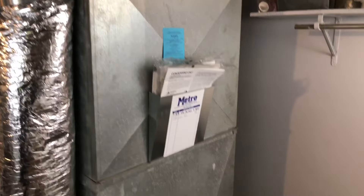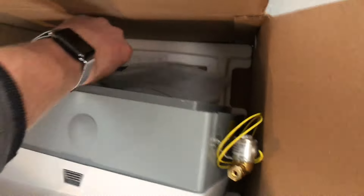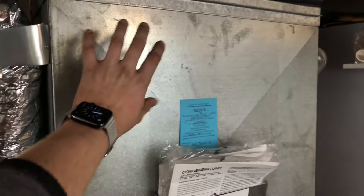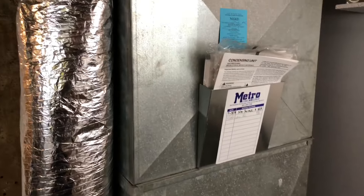I'm going to get the template for the cutout. The template is actually your instruction sheet — it's just an eight-and-a-half by eleven piece of paper. I'm going to put that on the furnace, make a sharpie cutout, and then I'm going to get my drill bit and my shears. These are commonly available anywhere for just a few dollars and will make this project very easy. So there we have hole number one. You can see my AC evaporator coil — I missed that pretty easily.